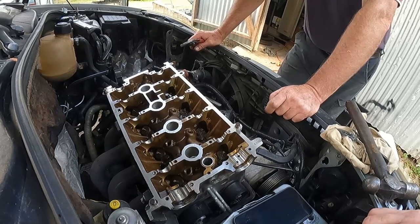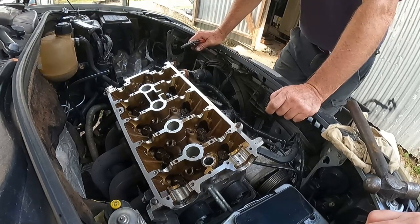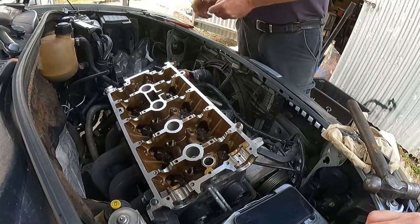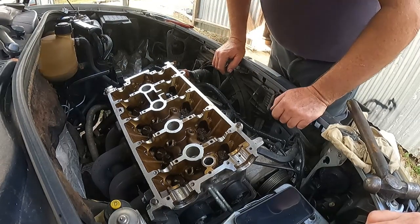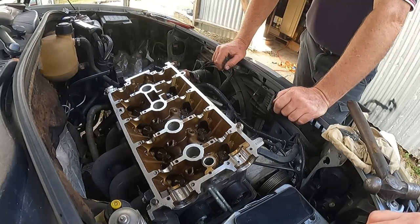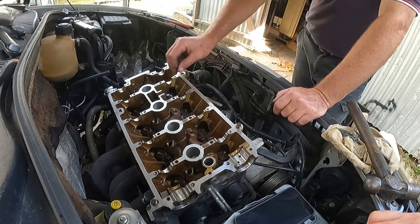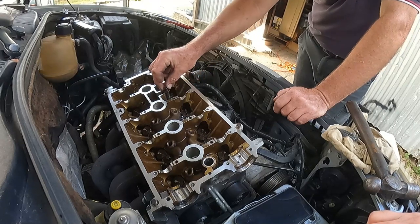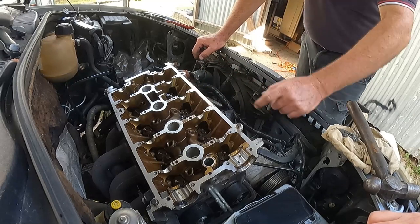Have you seen this before? Never. Do you have to drill it all the way? People I know have never seen this — they shake their head, never heard of this happening. So in theory you just drill a finer pilot hole all the way down and use a smaller screw extractor. I just don't understand — if I've already drilled a centimetre past the head and centralised it, this isn't twisting. So maybe the goal is just to keep drilling until the cap pops off.